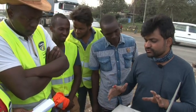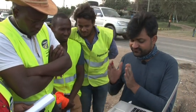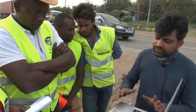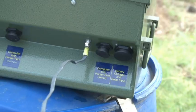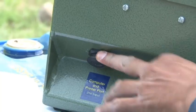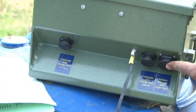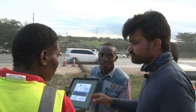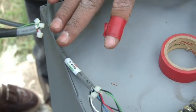I'm going to show how to connect the machine and all the connectors. One important thing to know is that just turning on the machine is not sufficient — you have to press some keys to let the machine start collecting data. On this side there is an earthing wire which we need to connect before starting the machine. This is the printer and computer serial input port, used for the modem. This connector is for the battery and charger — you must provide a regular power supply. This connector has two cables: one is for the piezo sensors.